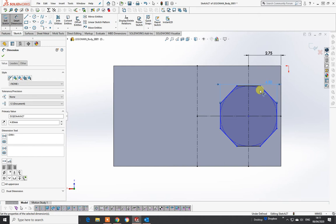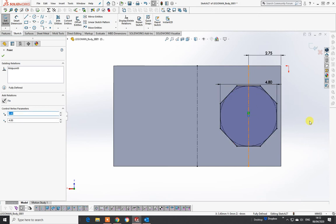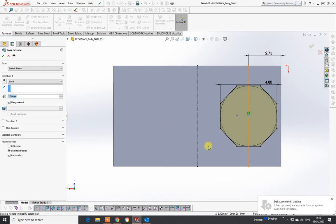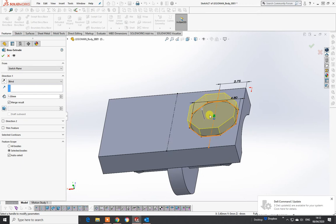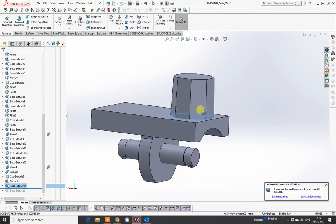This gives me a bigger section - you can see it's starting to get defined. I can get rid of that center line for the meantime and get this on the center point, and it's all gone black. I've got my outer ring. It's got two degrees taper from the center picture. Go to Features, Extrude Boss Base, flip it over slightly, go up four and a half millimeters - so 4.5 with a taper of two degrees.